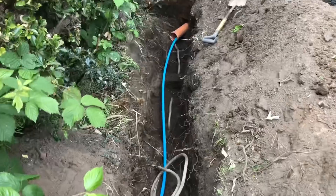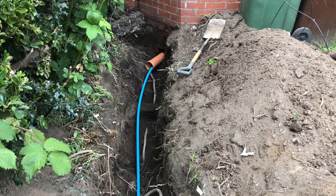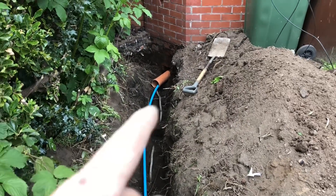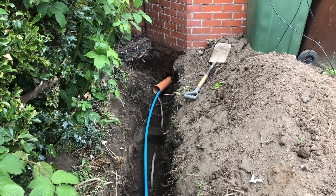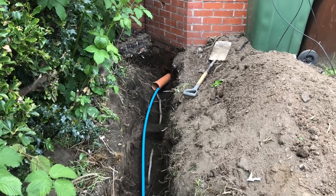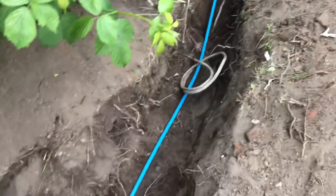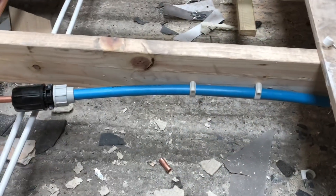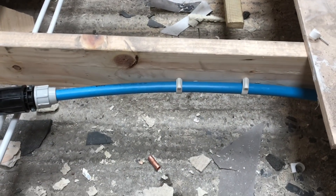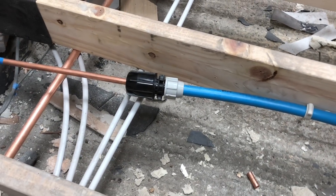So far we've got our first fix of the water main that's gone in. You can see we've got a four-inch ducting that goes through the wall — that's just to stop any crushing of the pipe. We've got a sand blinder underneath. Now we need to remove the stopcock as well, so that comes back up to the main. We've got our 25mm MDPE pipe coming into a 15mm reducer.